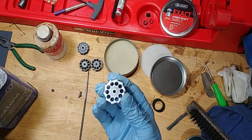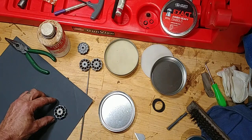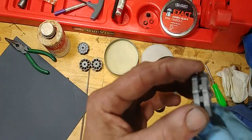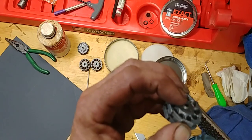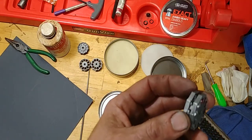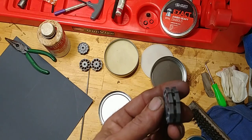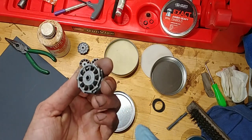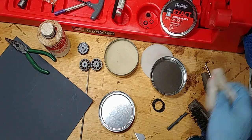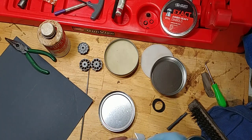And on the other one, I face it - as you can see the shininess. I prefer a piece of marble or glass and I will just do the face only. You can only do this with the face, and I'll show you why. See that little nub here? You do not want to shorten that - otherwise it will be sloppy and you do not want to mess with that. So just the face only. I look for any casting that may be on here and I will lightly take that down. And this is 800 grit - it just goes a little faster; anything finer like 1200 or 1000 grit is slower. So I like 800.